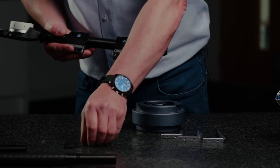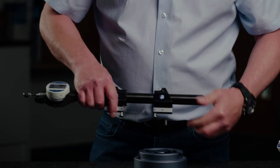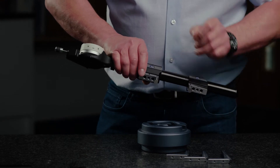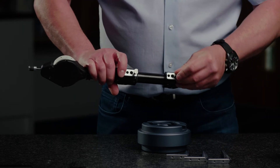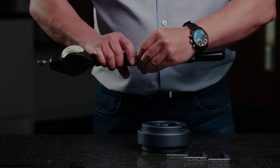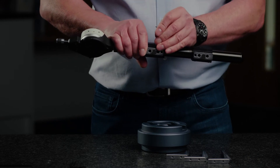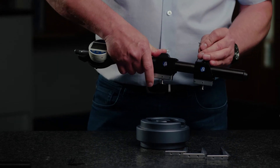Just to show you how quickly we can change that to an external diameter measurement — I've got a diameter here on the outside which is actually within the measuring range of my moving anvil. So using this different tooling location and setting the rotation of the anvils to external, let's just lock those in position like so.